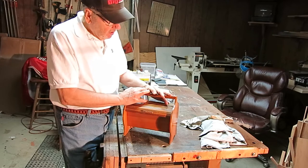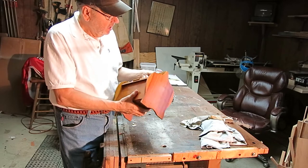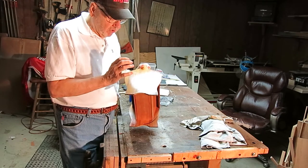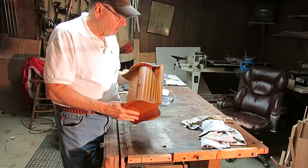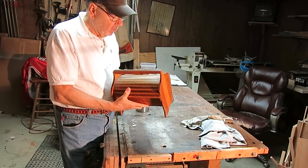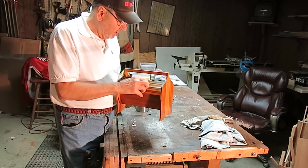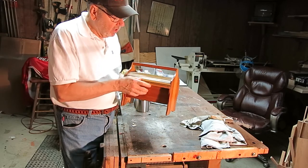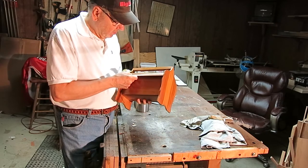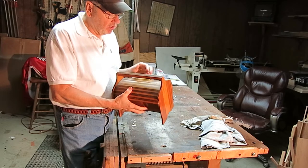So anyway, what I'm going to try to do is take it apart. It's got a nail right here in the end and of course it's glued. It'll have to be heated. This stuff is so thin, so old and fragile and brittle that it will break real easy. I think this is yellow pine, and the roll top looks like walnut. I don't know what the lighter colored stripe is — it's not pine. It looks like it might be maple, so I figured it would be something hard.